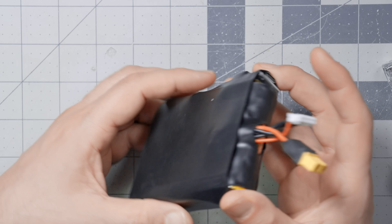If you're interested in building a 21700 battery pack just like I did, this is also a great way to save money. These cells are about $6 apiece, so four cells is roughly $25, plus another $10 in miscellaneous stuff — a 5,000 milliamp hour 4S battery pack. That's so much better value than any USB power bank you'd buy off Amazon. Don't look at the milliamp hours on commercial power banks, because those are usually rated at 1S voltage — this is at 4S voltage. I'll put a card on screen and a link in the description to the video where I built this.